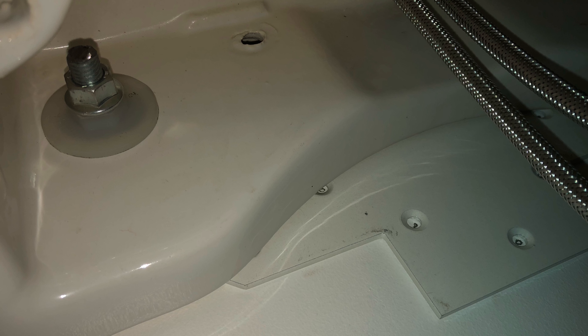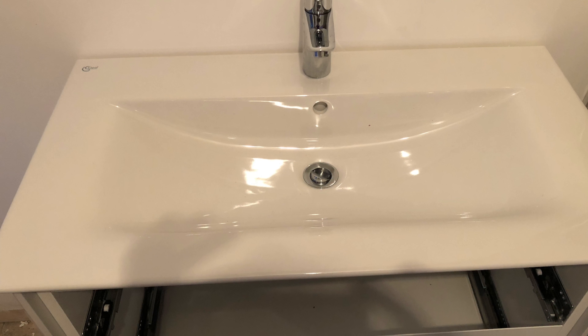This is underneath our sink, all screwed up. There's a splashback above the sink, so we're not going to worry about tiling around the bracket. It will throw the sink forward about 5mm, but that's quite handy because it keeps your monoblock tap another 5mm away from the tiles, giving you good clearance and a little gap to get sealant in before tiling.